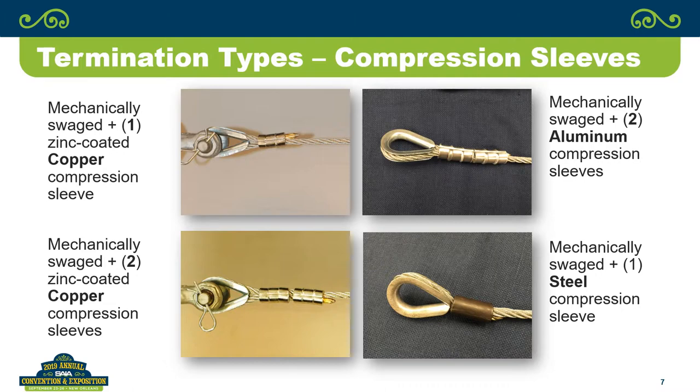Right. And I'll be the first to admit, on some of these other ones, even a standard copper with a zinc coating on it with a galvanized steel wire, in a highly salt atmosphere from a galvanic corrosion standpoint, not a great combination. The difference on the table is like 0.9, and you're trying to be as close to zero as possible. So if you're using it in a highly salt atmosphere, you've got to be doing a lot of inspection and make sure that you're not getting corrosion.